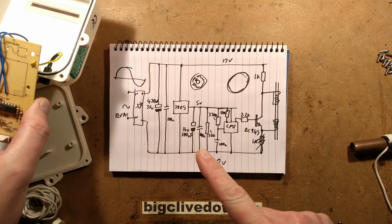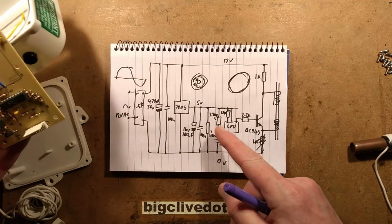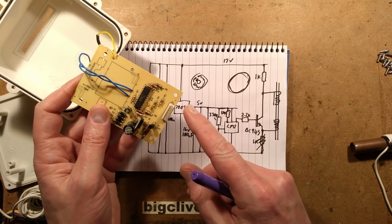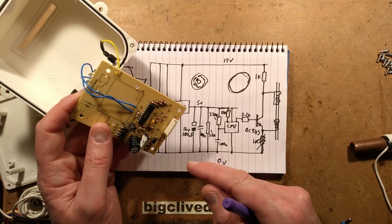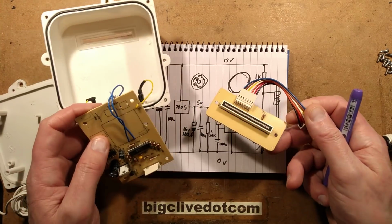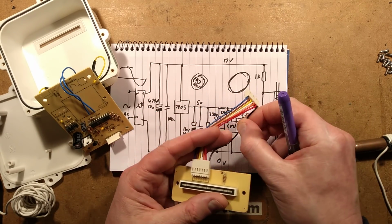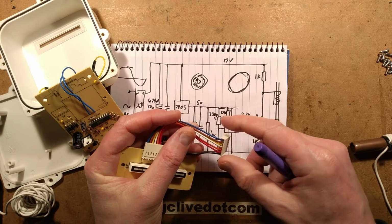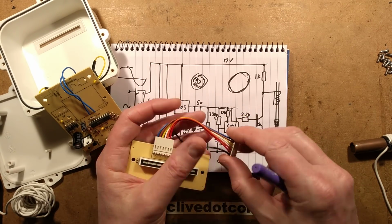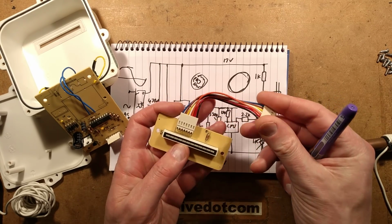My guess is, the LEDs. I didn't draw the LEDs in this because there wasn't a huge amount of room, it was going to be really cluttered. There are 7 pins. There are 12 LEDs. One pin, the one with the black lead, is the common, and it alternates between positive and negative. So it goes positive for one set and then runs through the channels, and then it goes negative and runs through the channels in that other set. That's how they've very simply multiplexed 12 LEDs onto 7 pins.